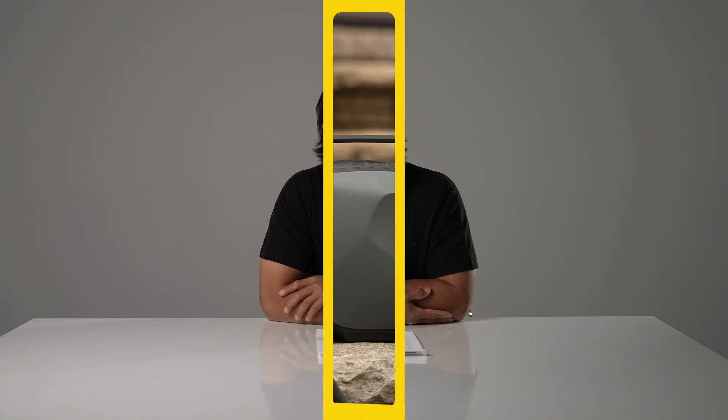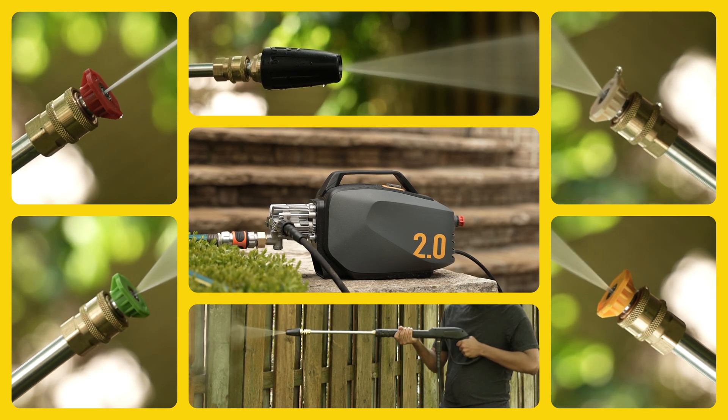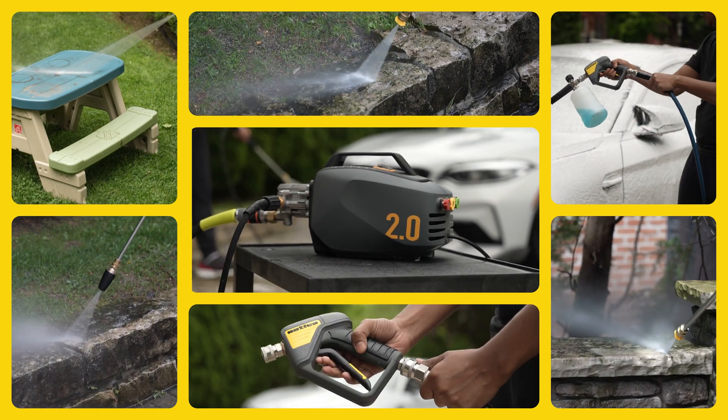Anything above 100 PSI will typically begin to hurt and can even damage the performance and pump of the pressure washer itself. Flow can be anywhere between 6 GPM and 12 GPM, depending on your particular water outlet and even time of day depending on where you get your water supply. So there's a big variance in water supply that will impact performance. The last factor is how the pressure washer is set up — extended hose, nozzles, whether you're using the stock gun — all impact the performance you'll get.